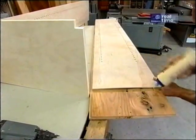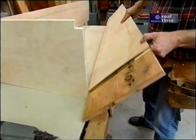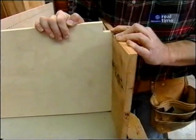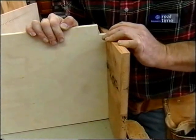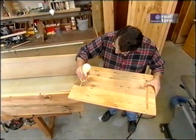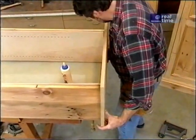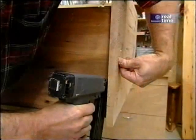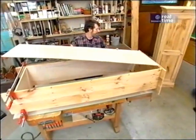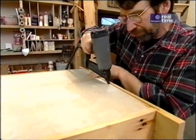Now we're starting to put the carcass together. Because the bottom shelf is plywood and the side is pine, I don't want to glue the whole joint — just the front edge. I'll bring the pieces together, make sure that the edge of the notch is flush to the front edge of the side piece, and secure it with some 1-1/4-inch brads. For the top, I glue the entire length of the joint because both materials are the same — slip it into the dado, line it up, and again secure it with some brads. For the back, glue all the way around in the rabbets. Even though this is only a 1/4-inch thick piece of plywood, it adds a lot of strength to the case to keep it from racking.